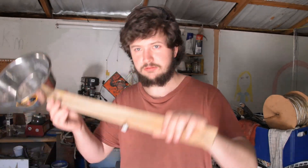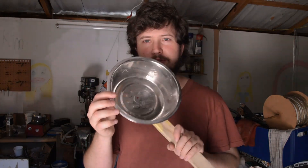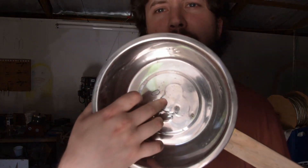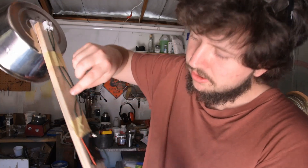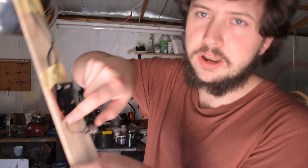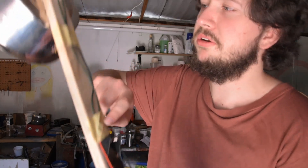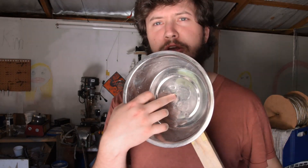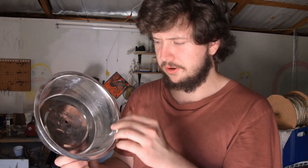All it is is a piece of wood. It's got a dog food bowl which is used as a reflector, and it's just got some wires coming out the back. There's a hole here for the pyrotechnic charge. The positive side is connected to the positive of the battery connector, and the negative simply runs to a little button, then through the other side of the button to the other side. In here is a modified little light bulb from a Christmas tree, and on that is a pyrotechnic charge or flash powder which gives off a flash, which you'll see later in the video.